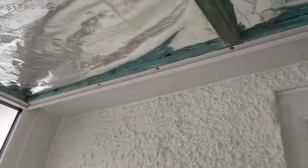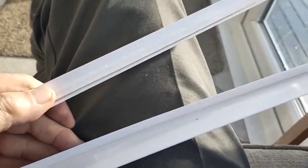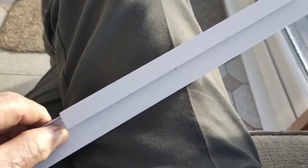You may have noticed in the bill of materials that there are 2 types of edging strip used. The cheaper one is a one-piece U profile, and the other, when assembled, forms another U profile, but it comes in 2 parts. So the idea is that at this stage, when mounting these edging strips, 2 sides of the ceiling have these single part U strips mounted. The other 2 edges of the ceiling have one part, the base part, of the other type of edging. At the very end of the project, the second part of these edging strips will be attached to finish off the job.